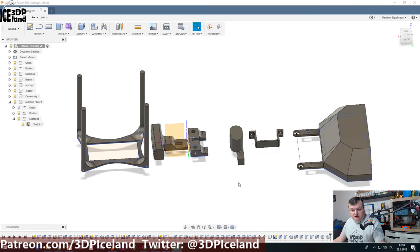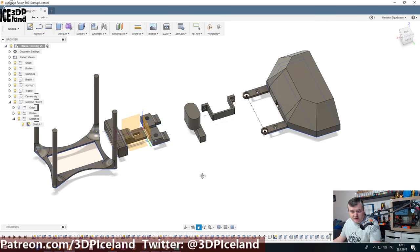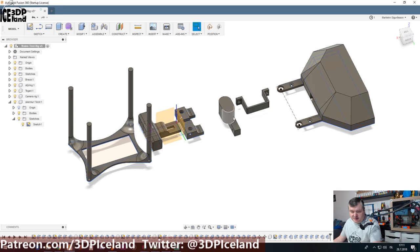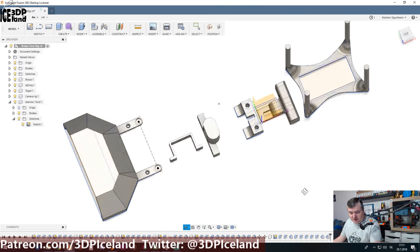All those parts were designed in Fusion 360. Let me show you in Fusion: here are the parts — this is the blast shield, this is a clamp that holds down the scale, and this part at the end of the scale holds it firmly in place and takes the load. I've pulled on the scale up to 25 kilos and this part holds up well. Then there's the pulling part, the guide for the pulling part, and the mount for the screen.